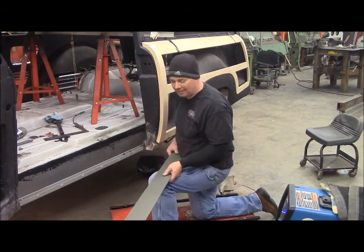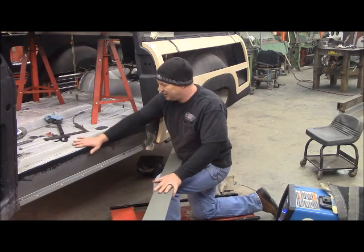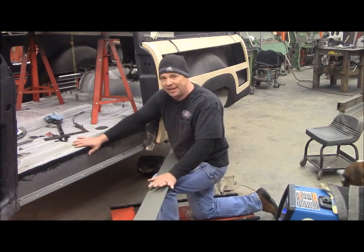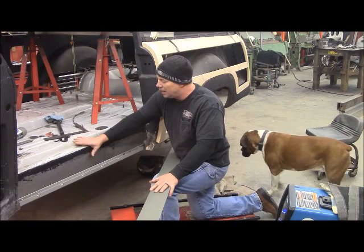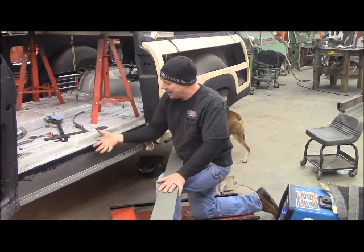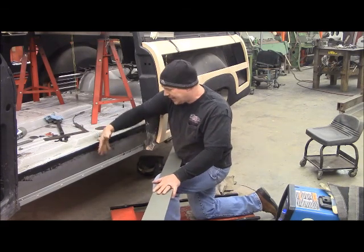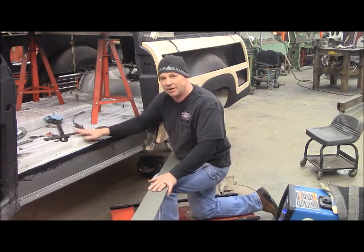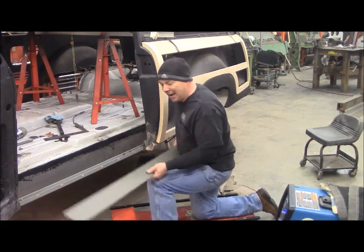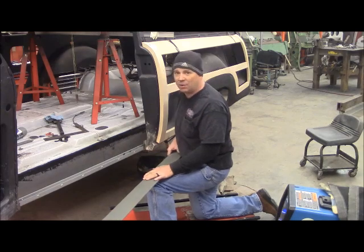This has been extremely difficult to get in because I'm welding this 3/16 to this sheet metal, and it's got to be strong enough to last forever and hold the weight of this vehicle, the body of the Woodie. So what I've done here is I've got this where it's locked on here. The way that's folded over, this panel's locked in, then I've got a foot of 3/16 under the bottom of this tacked in, and then I'm going to have this in here at an angle. So this is going to be locked in there to where it's not going anywhere.